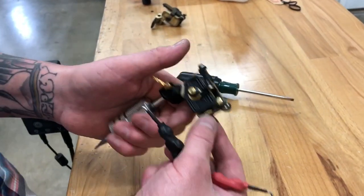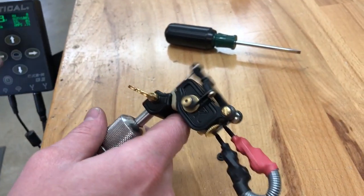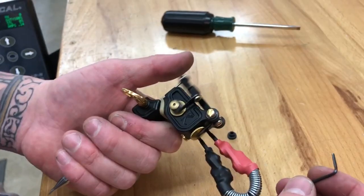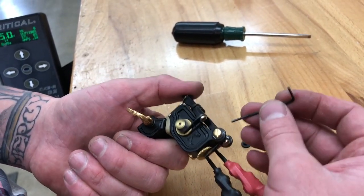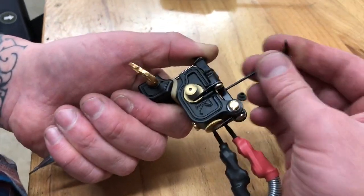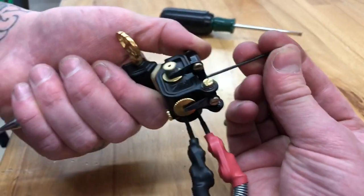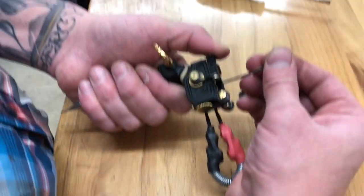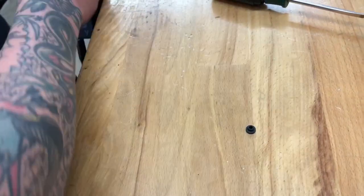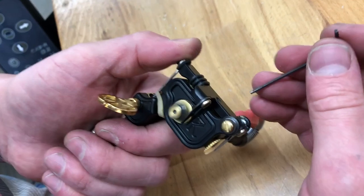If you did not change your stroke when getting the machine replaced, all you should have to do is set your impact screw again. Always load the machine when you retune it, otherwise you won't get a good reading. At five volts you can hear it's not hitting on the impact screw, so I'm just barely turning it in — just sixteenths of a turn. I can actually see the screw getting close to the frame, and now it's hitting. You can back this off, or turn it to five-and-a-half volts and start backing off until it gets a little duller.